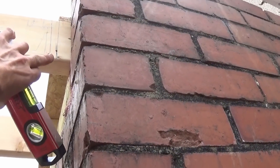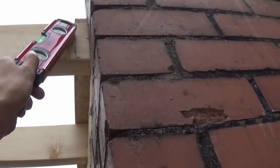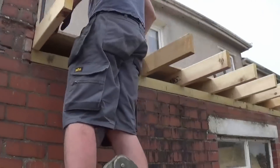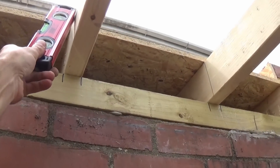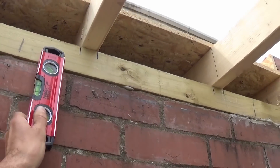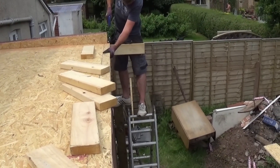We're going to cut these joists off now. Where we put the nail in the end and took the string line up and over, you use a spirit level and draw a straight line down, so that when you cut your joist it's flat - because your fascia board is going to attach straight to that. You want a nice straight line all the way along. Just using a hand saw, you can see the gap all the way along the front there now. Once you've got your straight line, you can run your saw along the edge of your OSB board and cut your joists off flush.